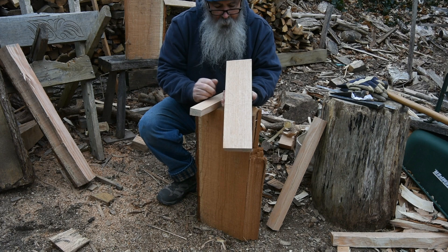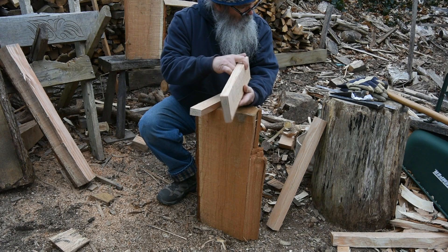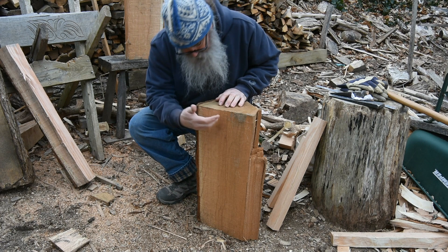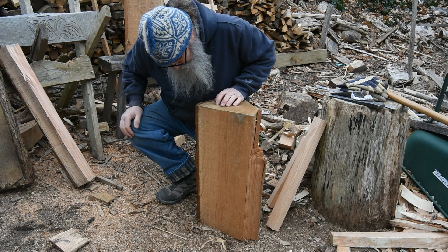It's too wide, probably — it's four and a half inches, but I'll split them around four inches, three and a half inches, by a thick inch. This is heavy, but you see the way this one grew. It's just so nice and straight, it's ideal for this work. So I'll show you how I sort of lay it out and then start to split it apart.